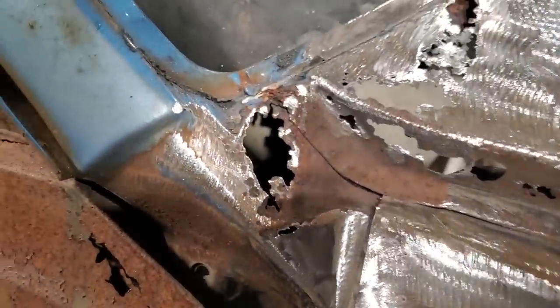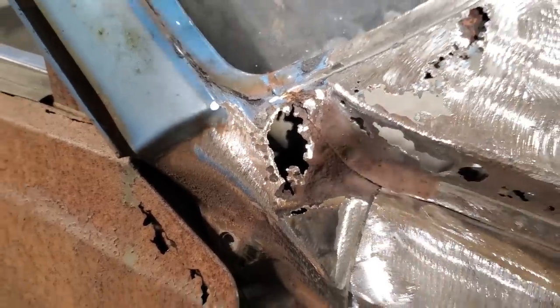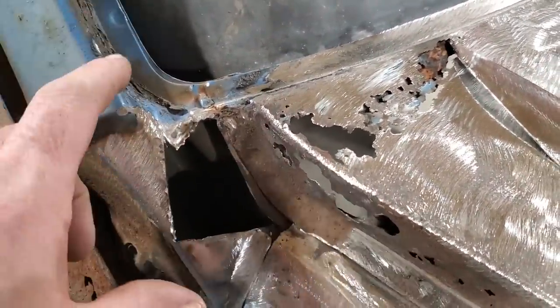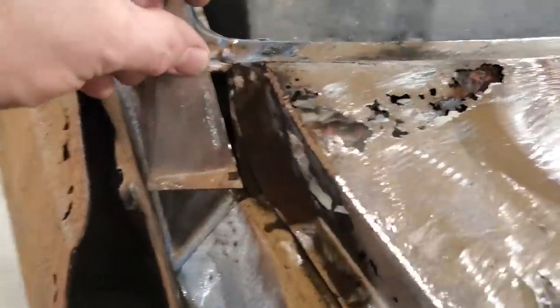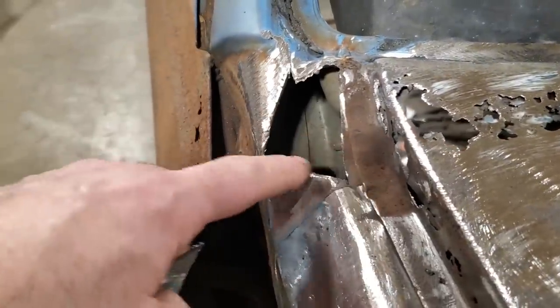And dressed. So now, let's go up here and I'll trim this off and clean off this section and get that welded up. Now this one's a bit tricky. I got it all trimmed out, a couple of shapes on the go here. You can sit down and try to make a piece to fit that perfectly. Nope, I'm not going at that. I'm going to weld that place on the bottom. You can see that there. I'm going to weld that there, and I'm going to concentrate on going up the side and getting this welded up through here and across the bottom here.